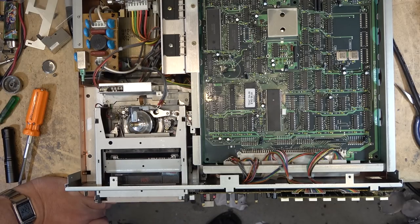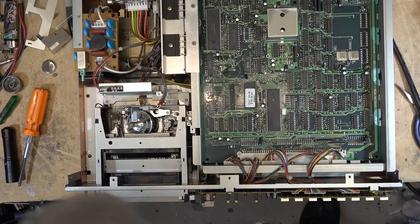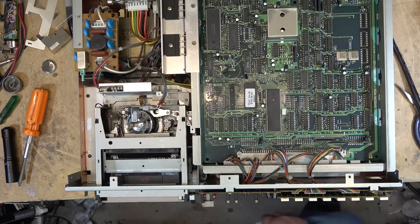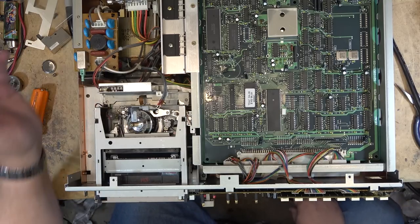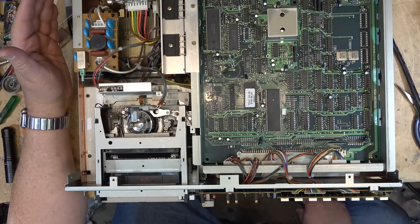So it saw the other tape had digital signals on it, but it wasn't a DAT tape. That's what it did. It booted the tape out because it read the tape to see whether it was a DAT format and saw that it had digital signals, but it was a videotape, and it booted it.